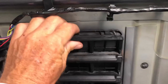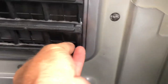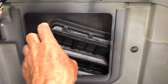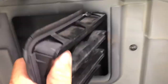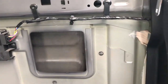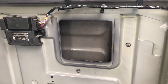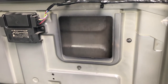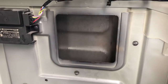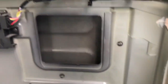I'm going to try to do it with one hand. Remove these by pushing the tabs in up top — just a couple tabs — and push it in at the bottom, then turn it a little bit. Once you're in, I don't care about ruining this one because it's done and it's out. I need two hands but if you turn it a little bit you can get it in without unbolting the bed of your truck or trying to pull it up between the bed and the back wall. I tried that initially with a string and it's too tight — it jams up and I can't get it all the way up to the hole.